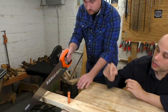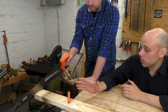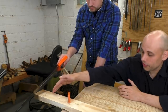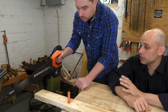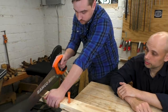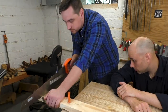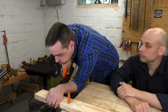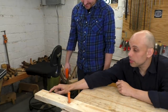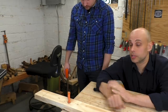Time out. What you're doing is you have a lot of angle on that, and you're cutting a lot into this edge before you've established your kerf. What you want is a much shallower cut — think about drawing that line back, all the same depth in the wood. And then blow out that sawdust as much as you need to, even while you're sawing, so you can see it. That's about right. You've got a really good kerf right here — it's going the entire width of the piece of wood and it's right on the line. That's actually really impressive for a first try.